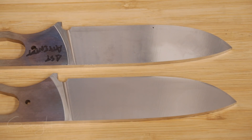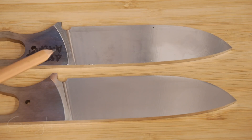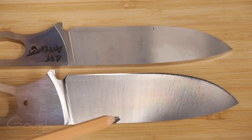Let's have a quick look at that blade we just machined. This is the one we just machined, and this is one I machined before I fixed the Z-axis. If you have a look at this one, you can see straight away that it's not good. Comparing that to the one we just machined, this looks really good. It's awesome that the machine is fixed and running really nicely. I've done quite a bit of work on this machine — lots of cleaning and electrical work — and I think it's a worthwhile investment. I got these machines very inexpensively, and in this case we didn't have to spend any money at all. I can't believe the problem was just those two bolts — it's so silly.